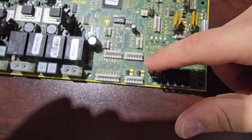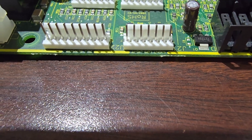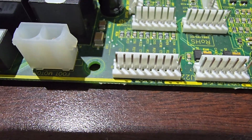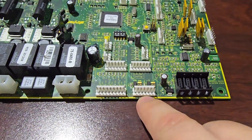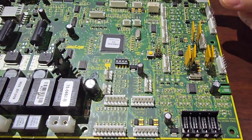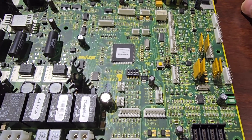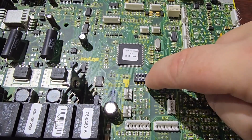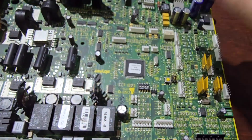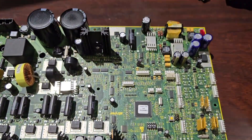Over here, even though this one may not be labeled, some of these connectors are. One says 'LBS light' and this one over here says 'tilt sensor' — so you can see there are sensors being connected. The LBS light is going to be a very low amperage connection. Do not press these buttons unless you absolutely want to reset a configuration, and likewise do not ever change dip switches, because they are going to drastically change the way that this board operates — maybe even put it into a programming or diagnostic mode. Not a good idea.